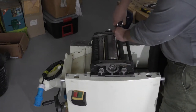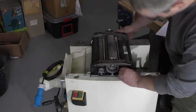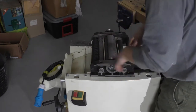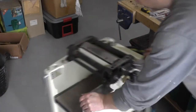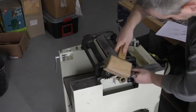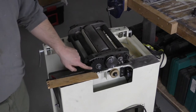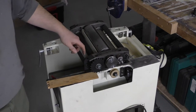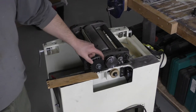While I'm at this, I'm taking this apart so much now I might as well give it a good strip down and a good clean. After considerable struggling I've managed to slacken off this nut which holds the sprocket on. I did it by jamming a piece of wood in there — basically there's nothing to hold onto, there are no flats on the shaft so there's no way to put a spanner. The only thing you've got to hold onto to stop the shaft rotating is this sprocket.